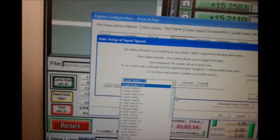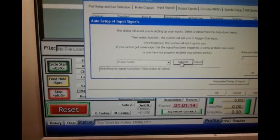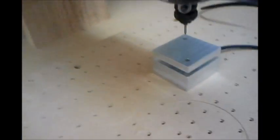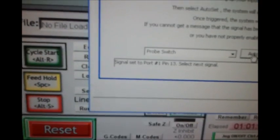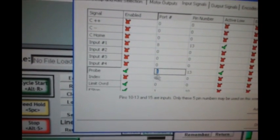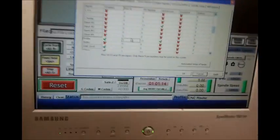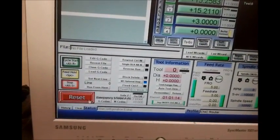Click the probe switch option, then click Auto Set. It will say 'Searching for signal activation' — it's waiting for the switch to be closed. Come over and close the switch by touching it. You'll see 'signal set to port 1 pin 13.' I know my port number is actually 8 and pin 13 is correct, but port 1 is not right. So come here and change it to 8 — port 8, pin 13. Now you know which pin you're on. Click OK, then reset because you had a configuration change.